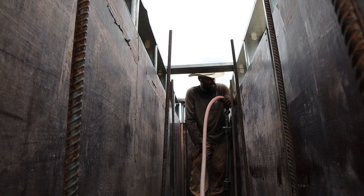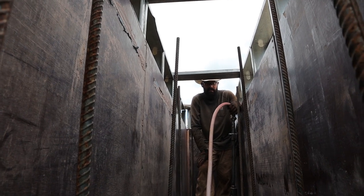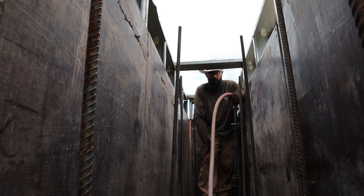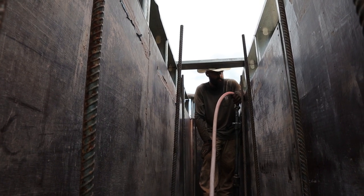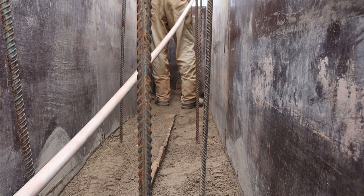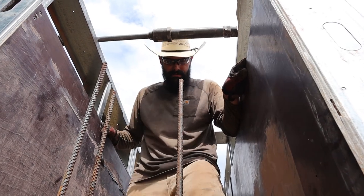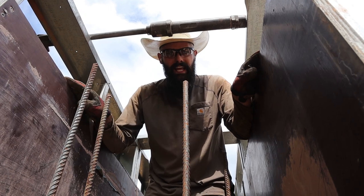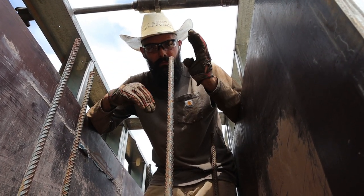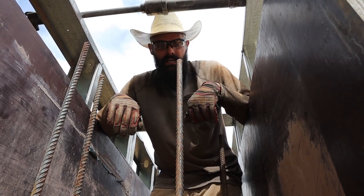I agree. What time is it? 3:35. Yeah, we can get one more lift in. I don't even think we'll need that piece — I'll just go lower on that side. We'll put that piece of foam in the end cap later. So what we did was one extra lift, putting two pieces of rebar over the window on this side and one on the other — three total, two layers, almost a foot or over a foot of rammed earth holding the window in place, all connected to the wall. Now we just gotta ram it.